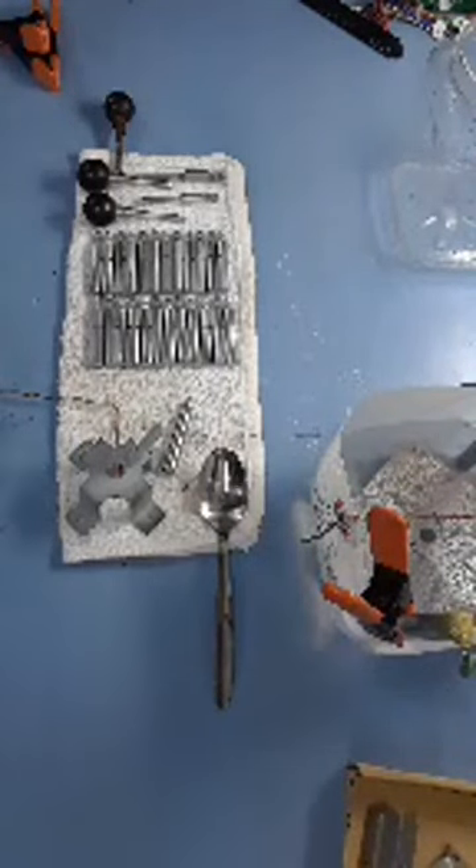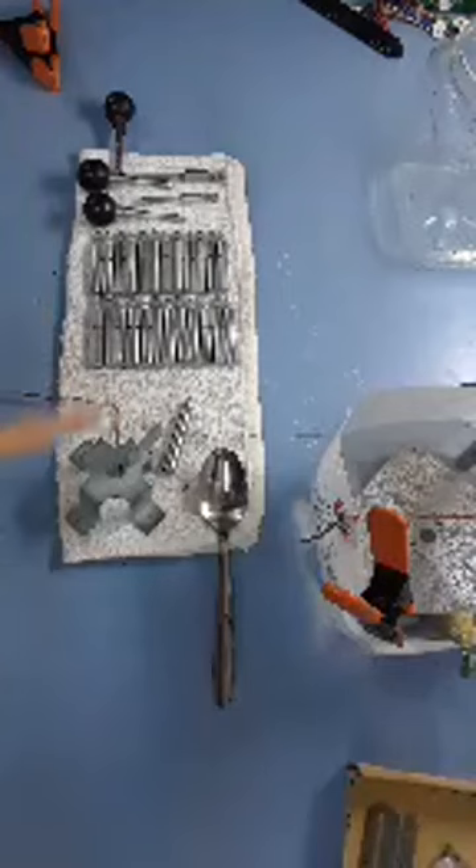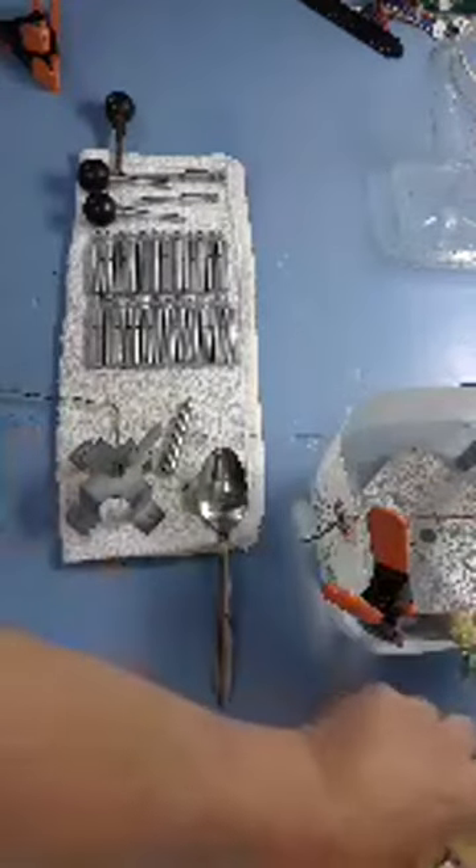Today I'm still working on the Sheriff controllers. What I'm doing is plating parts. I've already got everything yellowed and sent back except for my original controller. I'm taking all these parts — I've sandblasted them and cleaned them — and I tried some plating last night. It worked really well.